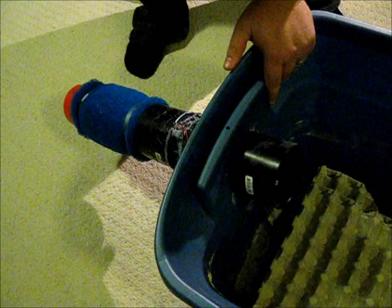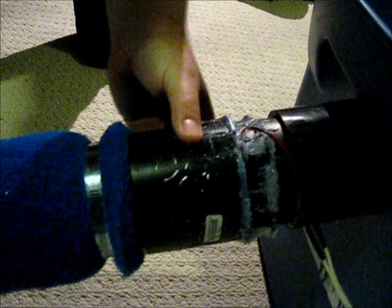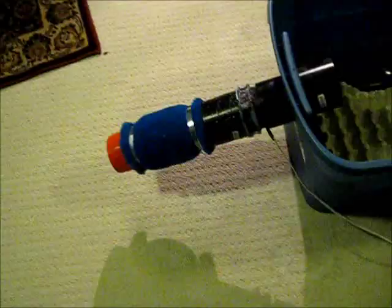Directly across from the intake, we have the exhaust side: a 3-inch flange with a piece of screen, a 3-inch pipe hammered into it, running out into another 3-inch flange — kept tight to the box so crickets can't get out. This runs into another 3-inch pipe, hot-glued to a PC fan that is sucking air out. From there, air goes into a flange, into another piece of 3-inch pipe wrapped with active carbon. There's also another filter inside, plus one of those car air fresheners — a tree freshener — to keep the air extra nice; the room kind of smells like wintergreen. On the other end we stuck a 3-inch to 4-inch PVC cap to keep the whole thing sealed and airtight, so all the air is forced through the two-stage filter.